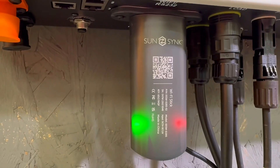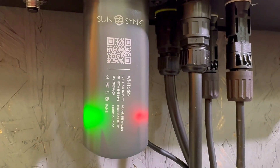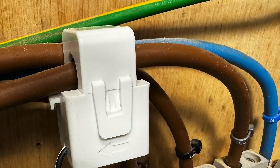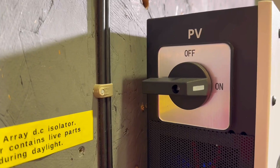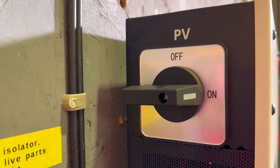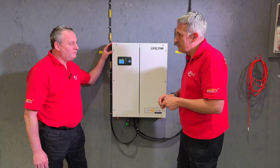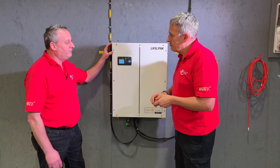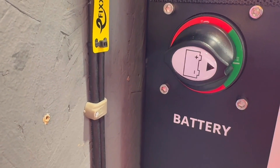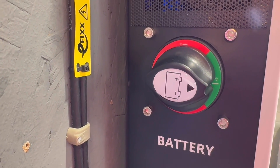It's just got instantly complicated for me — but it hasn't really. We've also got the Wi-Fi dongle, so we've got no hardwired internet connection required to get here. I've also got a connection for the CT if we're actually on grid. Around my side — very controversial; we've made some videos on this and we'll leave them in the link in the description. For this one, we've got a DC isolator here for the PV strings built into the actual inverter itself, so no remote isolator required. That saves you loads of stuff on the wall.